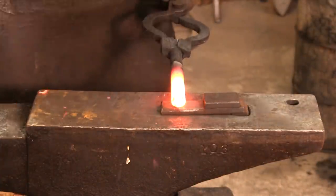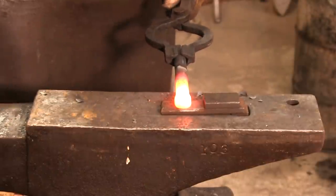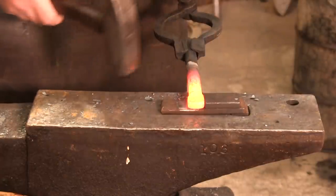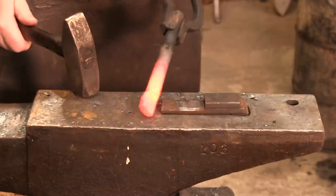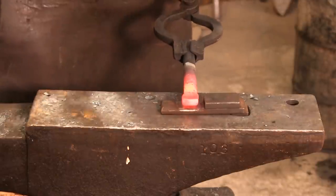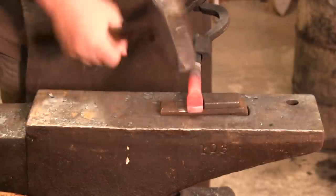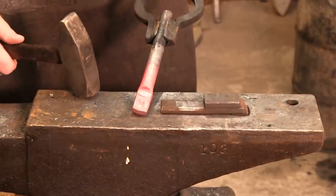So let me grab our steel here. Lay it right there, and I am going to keep it straight, keep it in line and square. Now again, look, I can actually accurately tell how thick I need to be. It is easy to thin it too much. And that can be the length of your jaw. Now you can actually make this a little bit longer if you just get a little bit more bite. Everything straight, and there you've got your jaw with no problem.